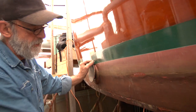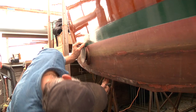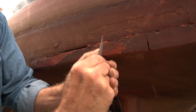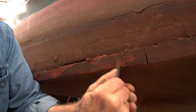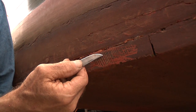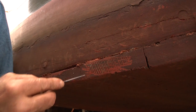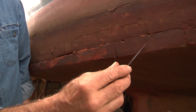I'm thinking the best thing to do here would probably be to unfasten all the planking from the framework and probably replace this bottom plank on the transom. Now I'm just scraping the ends of the bottom plank to show the annual rings in the wood. They run through the board this way, which makes it quarter-sawn. If the annual rings appeared the other way, it would be flat-sawn. This is all quarter-sawn — it's not a mix. It's made of quarter-sawn fir.